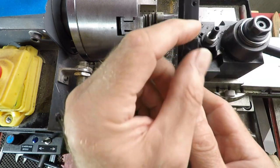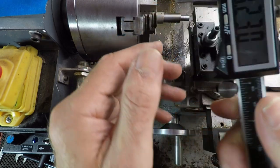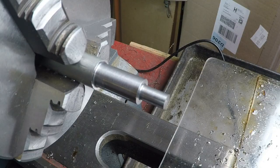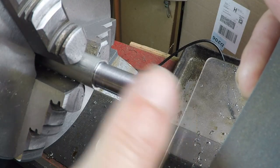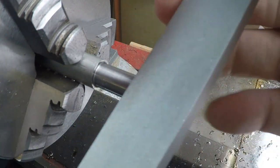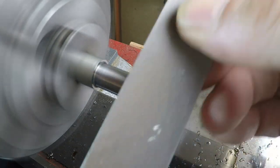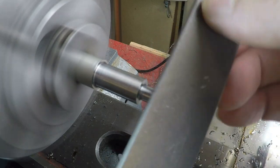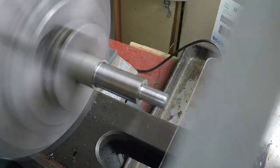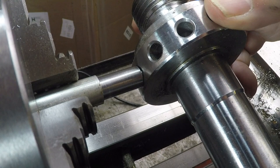Let's check and see how we're doing. Shooting for 0.230 — and I got it. Now I'm going to just chamfer the edges here a little bit so this will guide in better. By the way, I'll put a link in the description for this lathe file, which I really like. I'm going to test fit the spindle to make sure it fits — and yes it does. There's a little wiggle room, which is what I need.